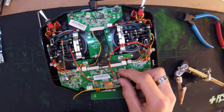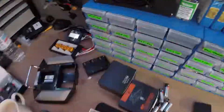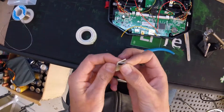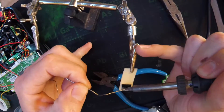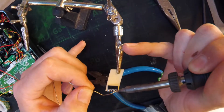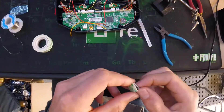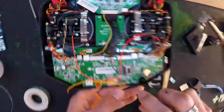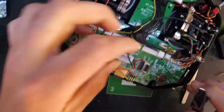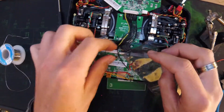What I'm going to do is get some VHB — some sticky tape — I'm going to stick him on there, then I'm just going to trim my cables and solder them to suit. A little tip when doing one of these videos: when you're tinning things over the top of boards, just chuck a bit of something underneath so you don't accidentally drop any solder on it.